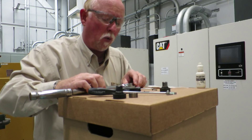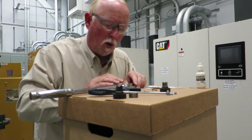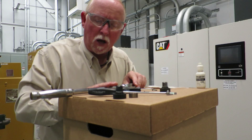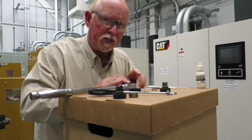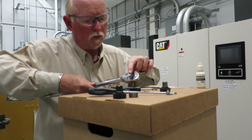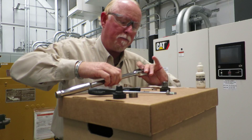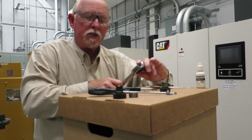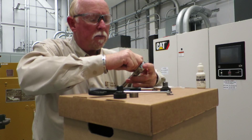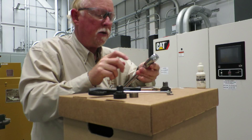We've got the new gear here. We'll use the old pawl because it's in good shape. What you want to do is fill this area with grease — get it all greased up in there. Even if it's not torn up, it's good to take these apart every so often, clean them out, and put some new grease in. It'll keep your ratchet running a lot longer. These ratchets take a beating — we all stand on them from time to time — and if you keep them nicely greased everything works a whole lot better. Pull this lever all the way straight up, then take your spring and ball and put them down inside.